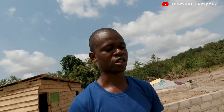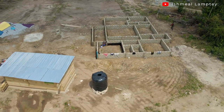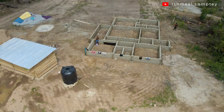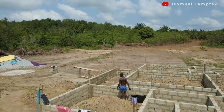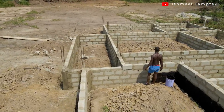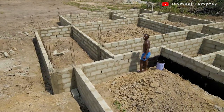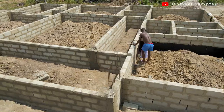As you can see, we are starting from the very base of the blocks which falls on the concrete, so you paint all the way from that section upwards. It is best if you can afford painting the entire foundation with the damp proof paint. However, that is going to be expensive, so what we are doing is painting the first three courses of blocks to see if the paint is going to be enough to come up. If once that is done and there is more paint, then we are going to continue up from that particular section.